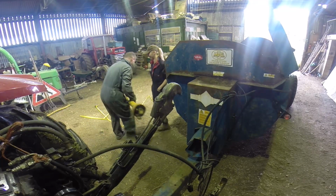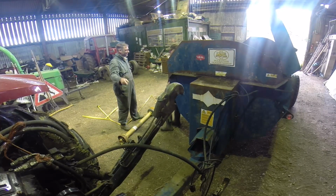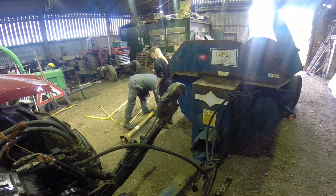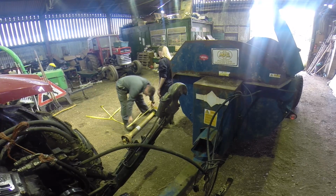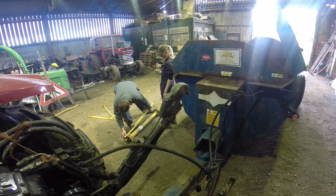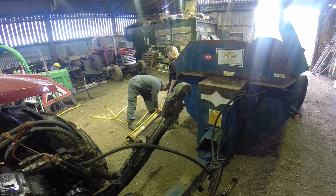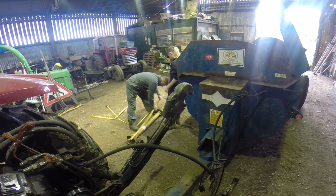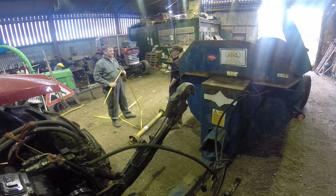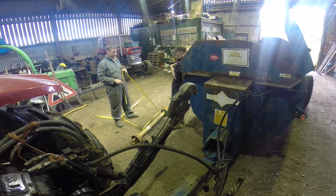Right, so it's 110 centimetres to the end of the shaft. Why don't you flip it so you can actually read it? There you go. Well done. We've got basically 130, and then 30. So we've got to take at least 20. But you need a little bit of overlap. So it'll probably be 30 centimetres we'll take off each shaft. Okay?